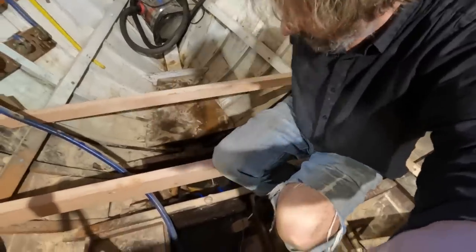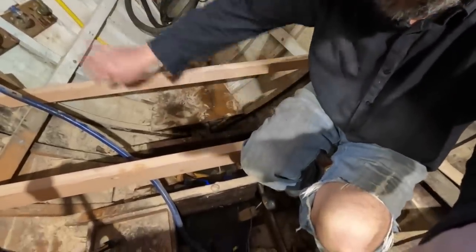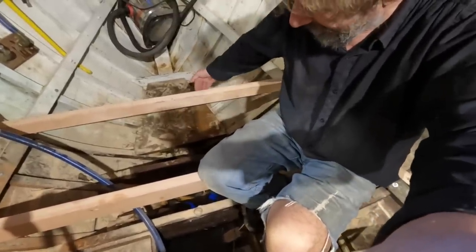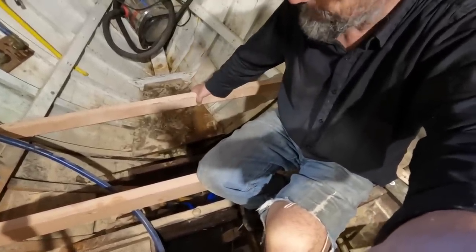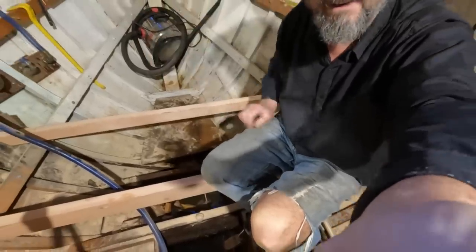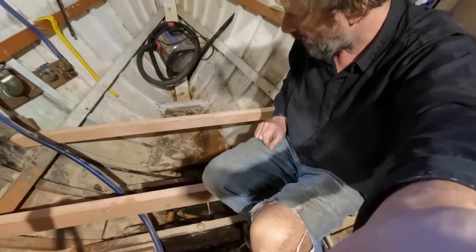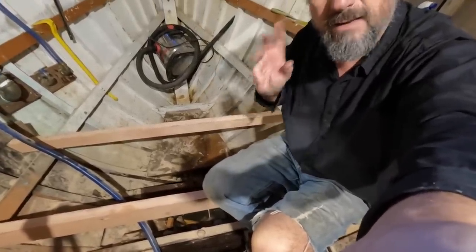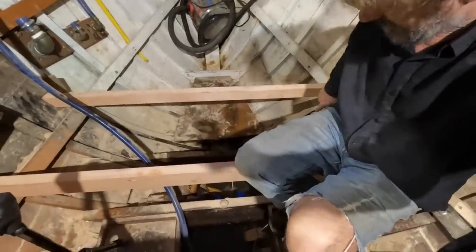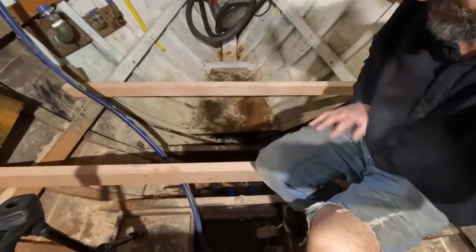So there'll basically be a triangle, well, I guess an arced half-moon sort of looking thing that'll sit down there and against halfway up this beam, and then two pieces because there's a rather large doorway here in the heading to the forecastle. I'm not quite sure how large yet, so that's something I've got to think about while I'm doing this. So in the meantime, it's basically just cutting and scribing a piece of marine ply to go down in there.